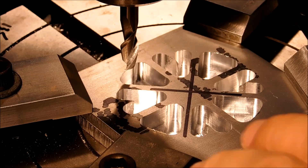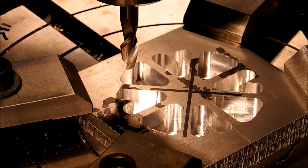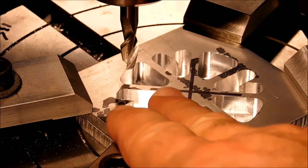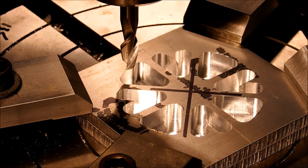I kind of like the way that looks — pretty cool. I am going to keep the cutter set on that particular diameter that I've cleaned up the outside walls with, and I'm going to relieve the center out of this like a spoked wheel.